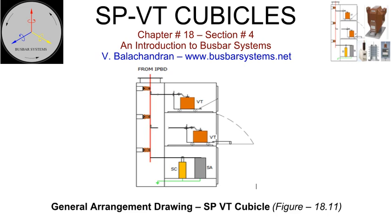On withdrawal of the voltage transformer, safety shutters automatically isolate all the high voltage connections. The draw-out trolley is linked to the panel door through a linkage mechanism that automatically performs the sequential operation. Other types of mechanisms have been designed that perform similar safety operations for the replacement of voltage transformers or primary fuse. Surge arresters and surge capacitors are always installed in fixed execution.